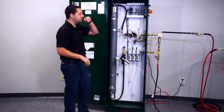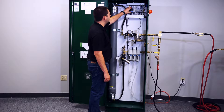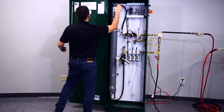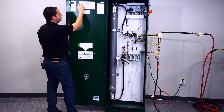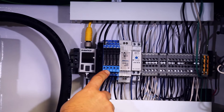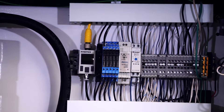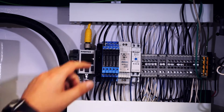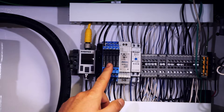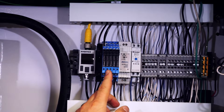The next thing I want to talk about is the monitoring points in the cabinet. We have a set of four relays here that are all used for monitoring. All of your landing points are clearly marked. You can reference this wiring label here on the door of the nitrogen generator cabinet to tell you what each relay actually monitors. The contacts on top of the relay are going to be your common, your normally open, and your normally closed landing points. The first relay here is actually your nitrogen generation mode monitoring — so anytime the nitrogen generator is on, this relay will be on and will report that back to a building automation system.